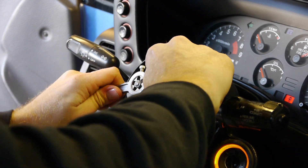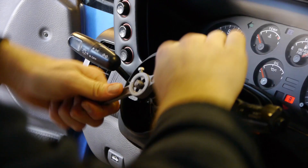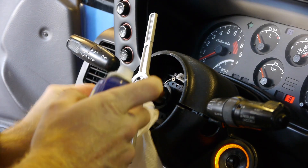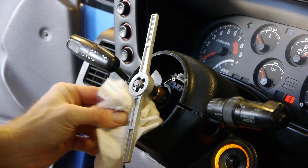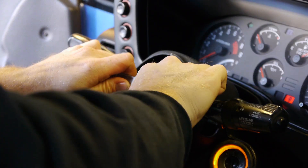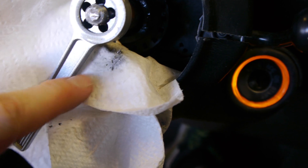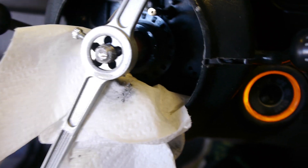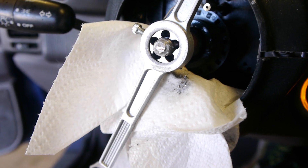Keep going here. I am getting close. It's getting tougher because I'm hitting those last couple of good threads that are left. So plenty of penetrating oil — WD-40, PB Blaster, whatever you got. When I spray the WD-40 in there and get to the thicker stuff, you can see the big chunks falling out of the threads. Those big chunks of metal — that's what you're cutting away. The WD-40 really helps slide that stuff out and keep your cuts nice and clean. Spray it often. You can never have too much lube.